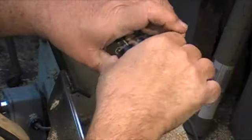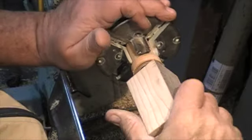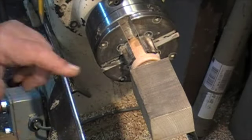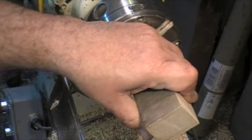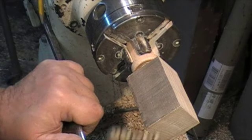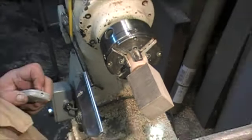I want to put a loop around. No magic to this. And then when I put it up there and squeeze it on, it's going to stop up early. It's going to stay back, and this is solid. I wouldn't really have to bring up the tailstock, but I'm going to turn between centers. Now, when you pull this one off, if you damaged a piece of black electrical tape, guess what you have to do? You have to put another piece of black electrical tape on it.